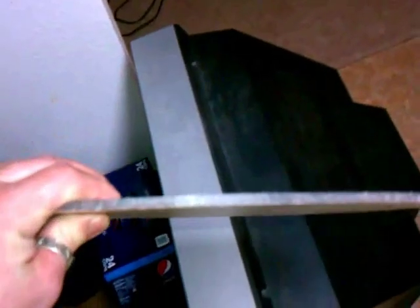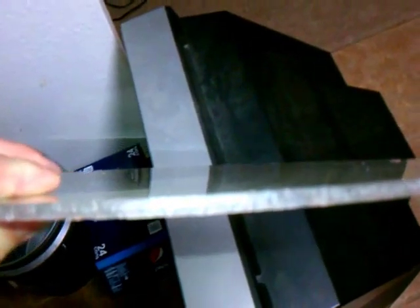You can see here where it's a little roughed up. So basically we're going to go back, and the heating process is actually going to do a little bit of the work for us, but we're going to go back with a Dremel on a really high speed. It'll melt that down and smooth it out real nice. Just use a lighter grit sanding drum if you have one.